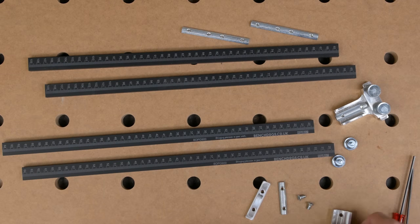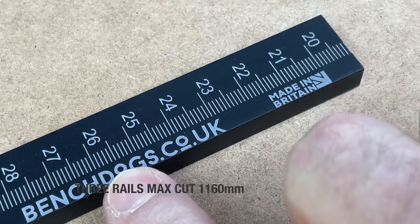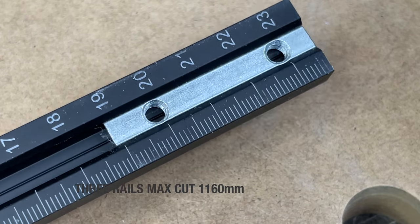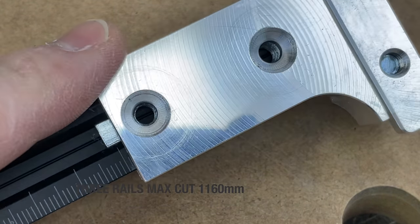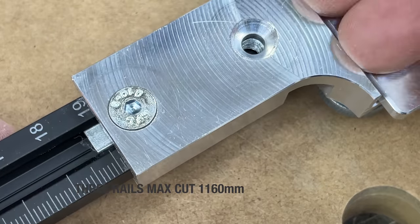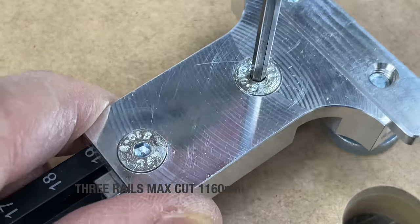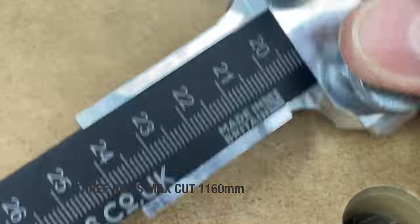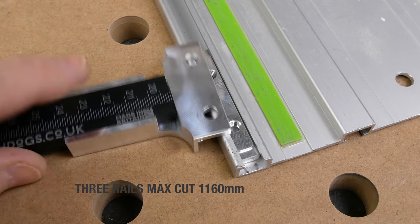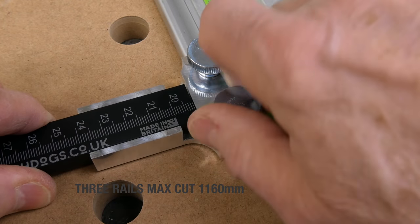So let's take a look at the two-rail kit and see how it all goes together — it is all very simple. There's a two-hole T-nut that slips into the underside of the rail at the end with the Bench Dogs logo. Then the body of the track adapter screws into the T-nut. We can slip the track adapter into the guide rail T-slot and then attach the body using the supplied thumb screws. And finally, add on the stops.